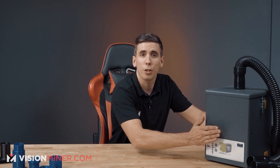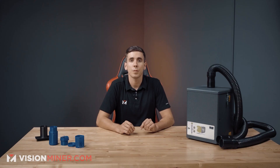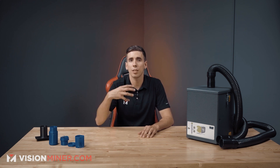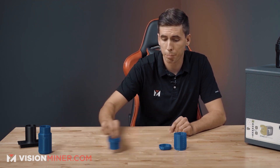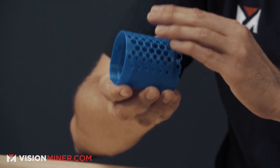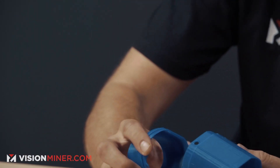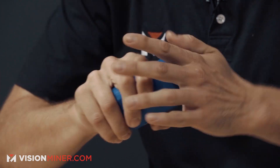The Print Pro 3 is designed to work with multiple 3D printers and multiple 3D printing technologies — not just FDM. Whether you're doing multi-jet, SLA, SLS, or another method, the Print Pro 3 effectively removes particulates and gaseous compounds emitted during 3D printing. BOFA even supplies free CAD models to create plenums and attachments for your machine or enclosure. The smaller plenums come in three parts that you can print yourself in a few hours and assemble easily.